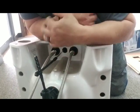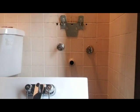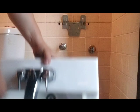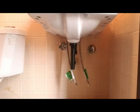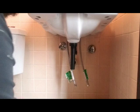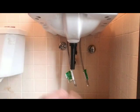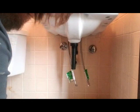Now we'll mount this to the wall, connect our drain to the wall, and we'll be done. Once you're back in here ready to go and your bracket's on the wall, grab your sink and just set it in place. And there it is. Then obviously when it's all said and done, you'll caulk it to make sure it's secured to the wall. I have a video on this channel on caulking a sink, so just go back and watch that video. And now you just want to hook up your drain and your supply lines and you're good to go.